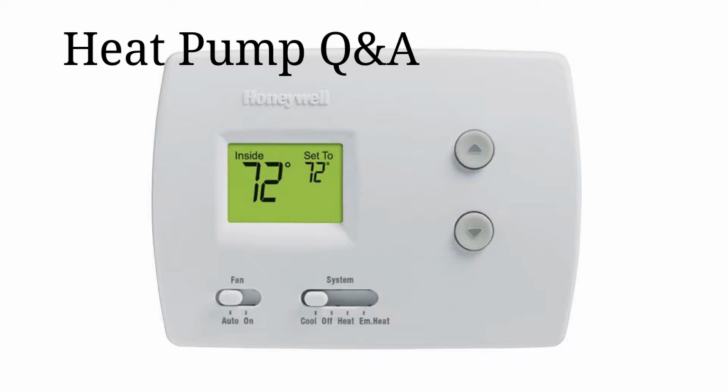The first question is, when should my auxiliary heat come on? Your auxiliary heat is going to come on when the balance point, or the desired heat that you have entered on your thermostat, cannot be reached using the normal air outside because it's too cold. This temperature is usually right around 35 degrees. The thermostat senses this automatically and turns on the electric heat strips to provide the additional heat needed.